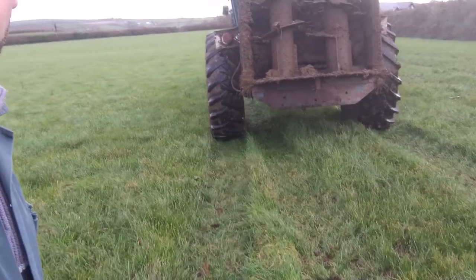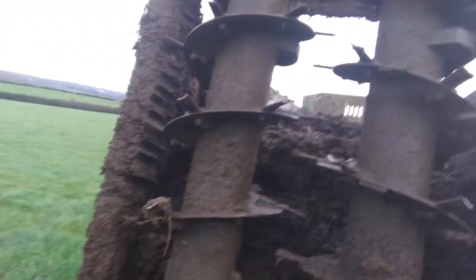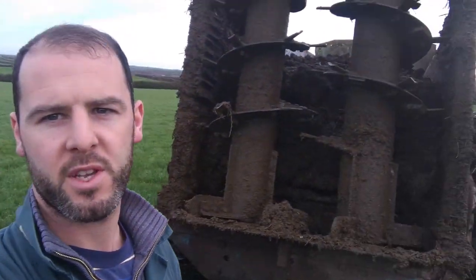I've just jumped out to have a little look. Only putting it on really light - I want to get around a couple of fields. As you can see, it's pretty thin, not very easy to see on the camera, but there's lots of ground cover, lots of grass, and we aren't getting any marks at all - it's ideal. At the back of the spreader, the beaters rotate and chuck it out, and the bed chain on the floor moves it to meet the beaters. Right, I'm gonna carry on - probably see you at the end of the day.